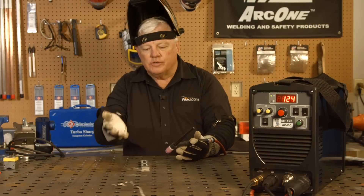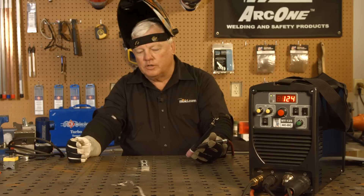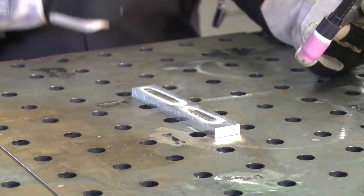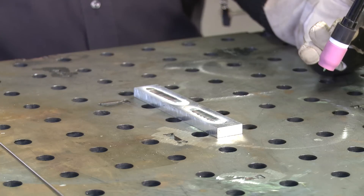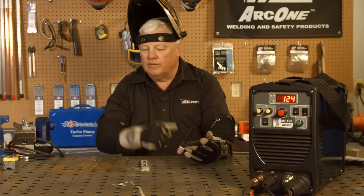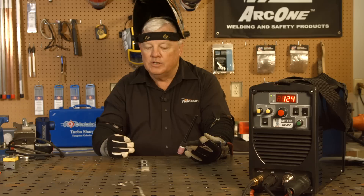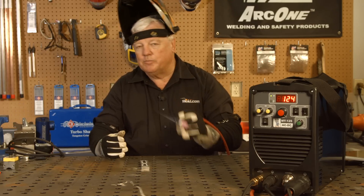I welded a 3/8-inch thick plate — it wasn't a very big plate — and I used 125 to 130 amps on my little AC machine. I was removing the oxides while welding. The first part, about an inch and a half long, I had the plastic 2.0 cheater in there, and hopefully you could see the difference when I went from the plastic over to the glass — I certainly could. We selected heavy aluminum so you could see; the lumens coming off aluminum give you a better chance to see what's going on. What's really amplified a hundred times is when you start welding really fine welds — down in the 5, 8, 10 amp range on DC — there's not a lot of glow there to see, so you do need clarity. Just giving you some helpful hints that you'll need in the future.